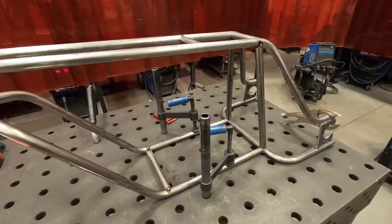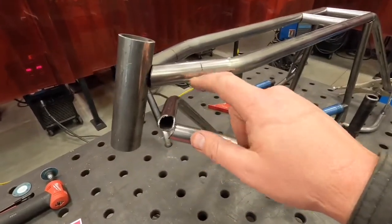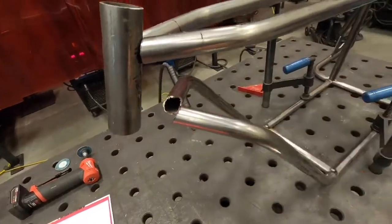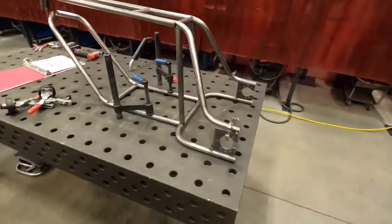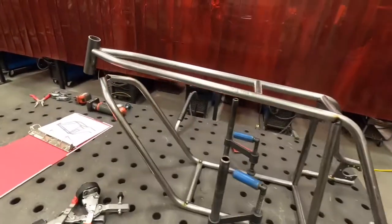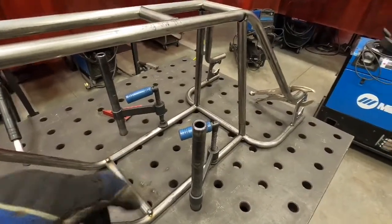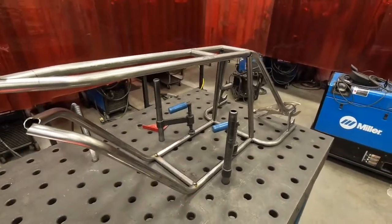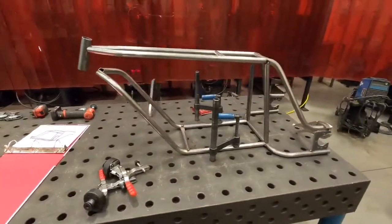Some of the things I had planned in my mind aren't quite working as well as I thought out here. I need to shorten this in just a little bit when I add my head tube off the scooter, but I'm pretty sure there's going to be enough room for it to go right through here. That is my drag trike frame in a nutshell - this is getting the two-stroke CR80 motor in it. I've got the axle hangers tacked in there. Everything's just tacked. When you guys are fitting your stuff together, only do tacks. Leave it tacked all the way until you've got the motor mounted, your jack shaft if you need one - everything is all in place and fits - before you actually do any solid welding. That way, if you've got to change anything, it's not going to be a nightmare because you only tacked it versus welded it solid.